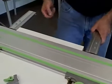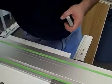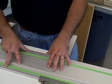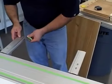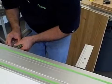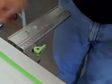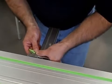And that's what we're going to do now. A couple of things I like to do right from the get-go. You see this? I have this labeled B — this is my B saw. I believe I've been using this saw for this application, but I want to tune it, I want to calibrate it to my guides. So what I'm going to do is take this index right here and slide it on until it reads zero. I like to start with zero because I'm going to show you a quick and easy way to calibrate this. See that? Lock it in at zero, just like that. Then I'm going to take this and lock it in at zero.